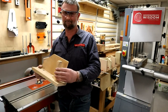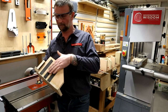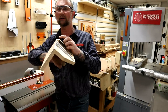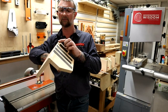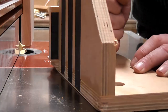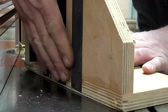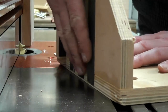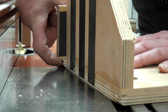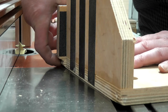This little jig. So I've got a handle. I've got some grip tape. And I've got a little push block. There's the remains of, in fact, if we go to camera three, right? So my handle, this area here is where my timber sits. This surface here is what pushes the material through. And you can see that I've cut into it a little bit. This gives the back of the cut a little bit of support and helps stop some of that breakout.